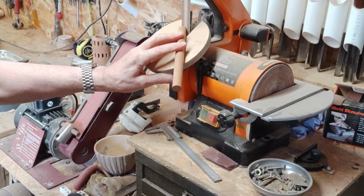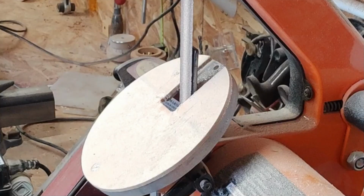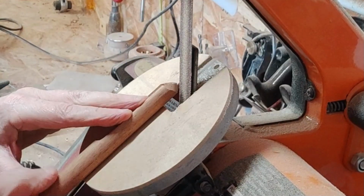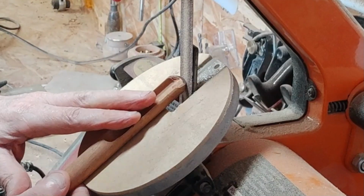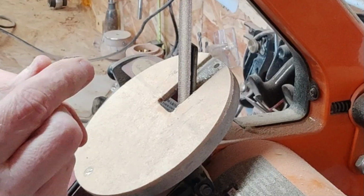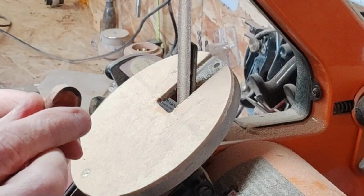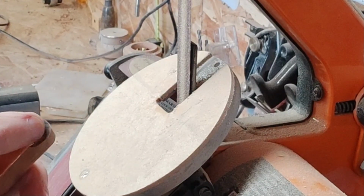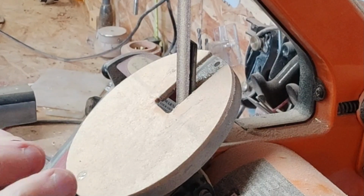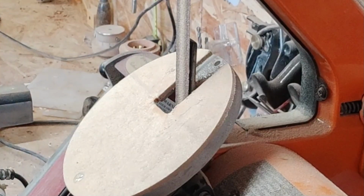Instead of using the grinding wheel, which was only there to illustrate it, I'll show you on this of the rest, which I have done here. And then it was a simple matter of grinding this round until we could follow the contour of the flute and the angle and the shape of that which the angle makes with the flute when it's been ground back to that angle. So that is our sweep.